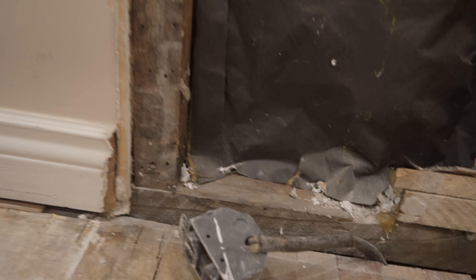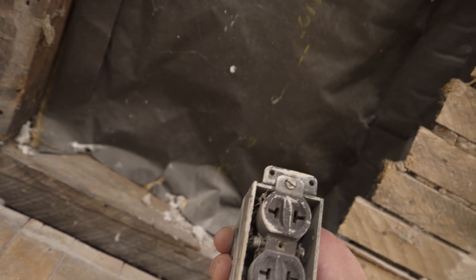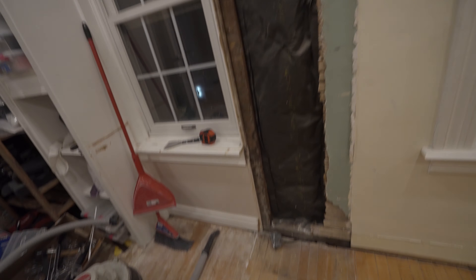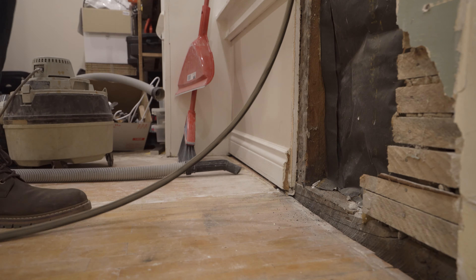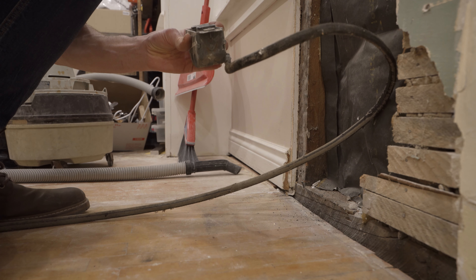The question is: where did the other line go? Do I still have power up here? Is the world's sketchiest outlet actually alive? Well, that's nice. Two wires, no ground, no wire clamp, wasn't secured in the wall in the slightest — but at least it's only got two prongs. It honestly seems like that one wire only services this outlet over here, which is great because I can pull that out and it's no longer a hazard, but we can still have light in this room. I feel a lot safer now that that's gone.